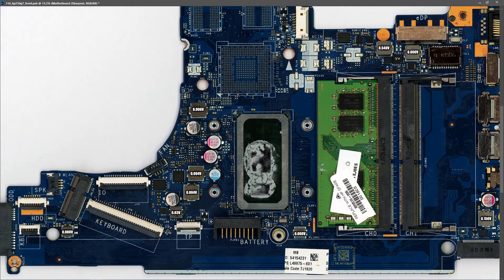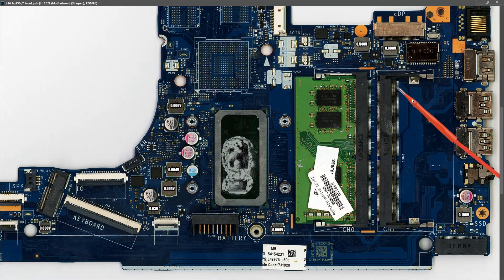So that's them all. I'm sure we can all agree at this point that the prospect of a repair here is not looking good. What I'm reading is: we have a short at PL301, a short at PL302, and a short at PL1001. Now these could all be shorted back through the same component, or possibly we have shorted components on those three separate rails.